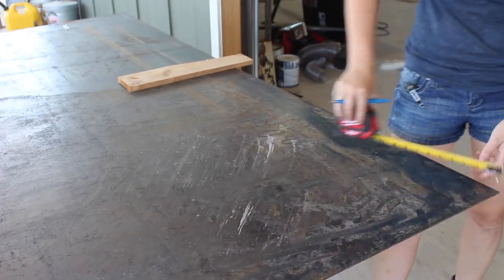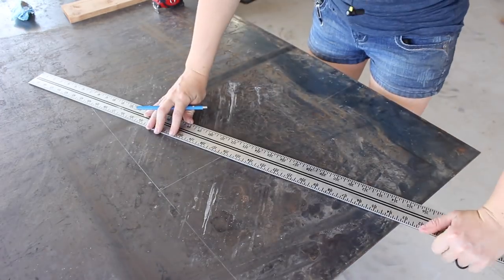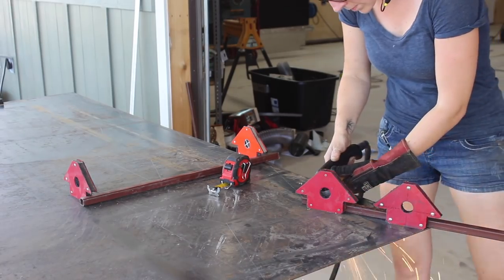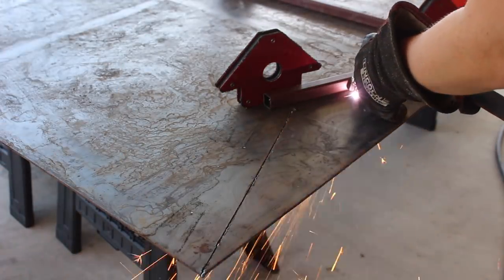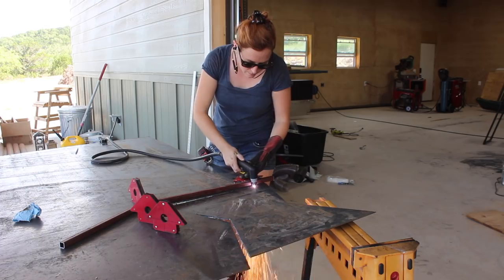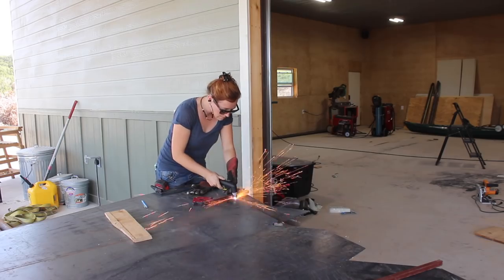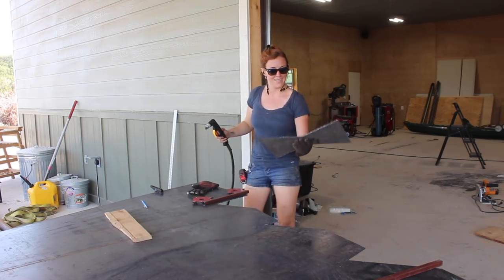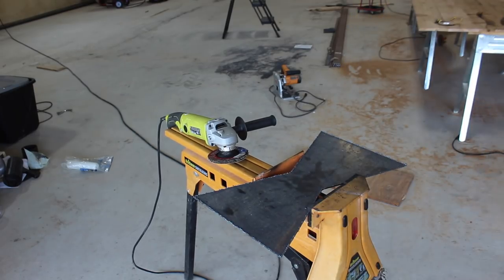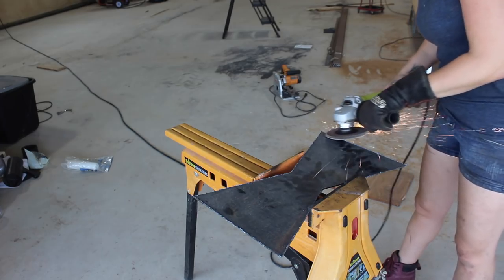Up next was making the bow ties. I'm making these from sheet metal and will paint them the same color as the frame. I'll need five total — the biggest coming in at 24 inches and the smallest at 16. I freehand a lot of stuff with the plasma cutter, but since I wanted these lines to be as spot-on as possible, I set up a torch guide using a scrap piece of tubing and tube magnets, positioning the bar half an inch outside my cut line so I could rest my cutting torch against it and cut perfectly along the line. When using a plasma cutter, the cut leaves a buildup on the back called dross. Since I want the bow ties to lay flush in the slab, I stuck each one in my Super Jaws then used a grinder to knock off all the back dross.